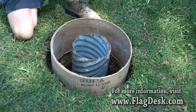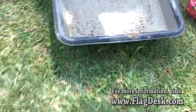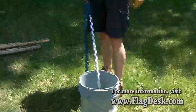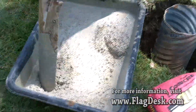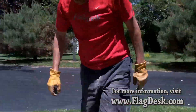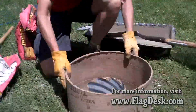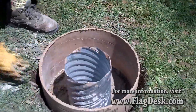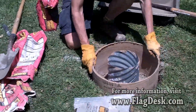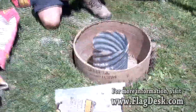With everything level, when we put the flagpole in we'll have some adjustment. We're mixing concrete in our portable little pan, making sure we get it mixed up right with the right amount of water. This is quick-set so it's going to set up real nice and fast. We've got our base of concrete in and we're going to check how the sonotube pedestal fits — about three inches high, level, slightly under the ground sleeve so drainage slopes away properly. We're in really good shape.